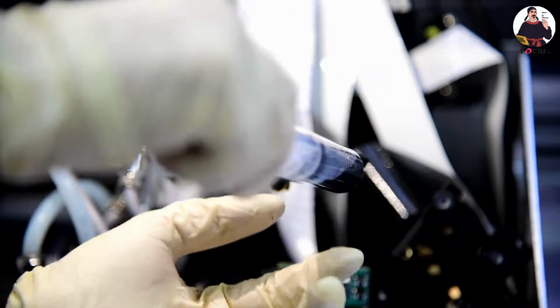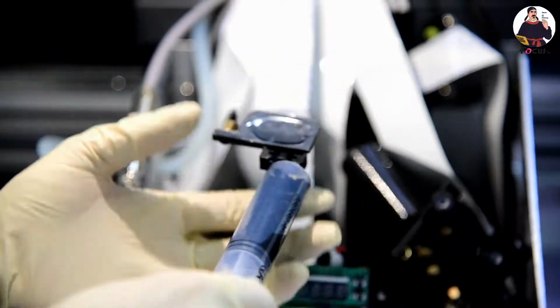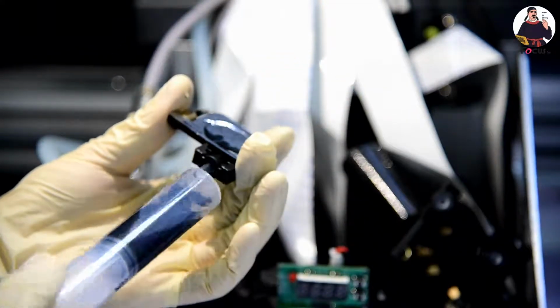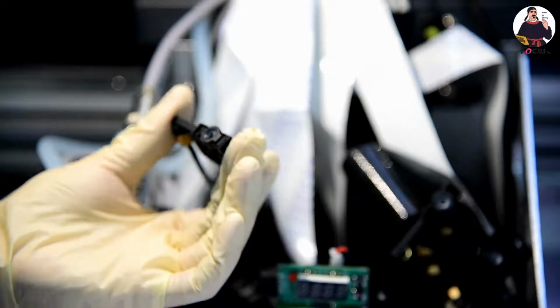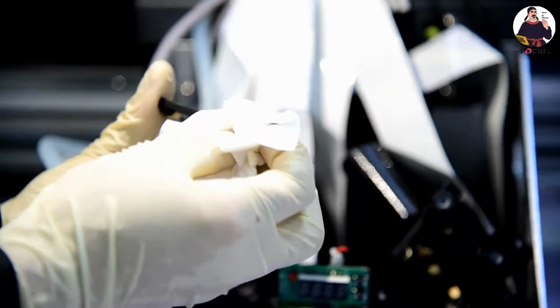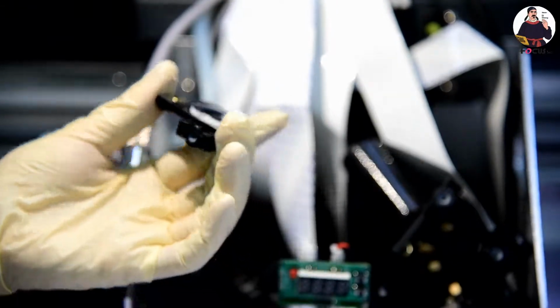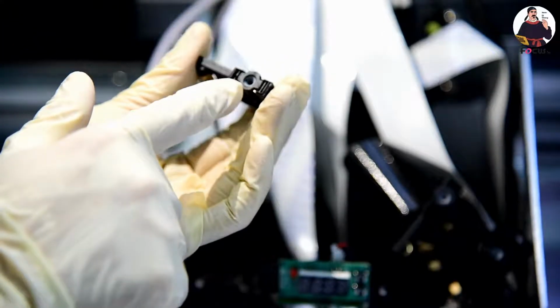Keep the syringe without loosening. It makes an automatic stop. Cannot release your finger right now. After there is no pressure in the syringe, then release the finger and take it out. This rubber must be without any ink, otherwise it will leak. And be sure the rubber inside is straight, no bending.